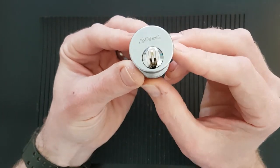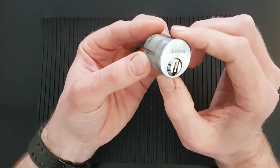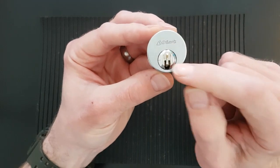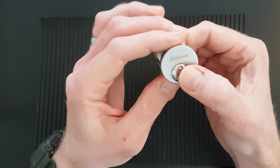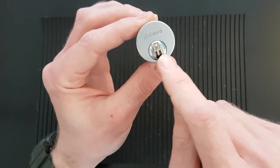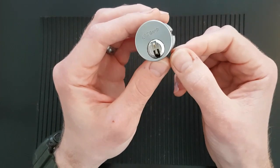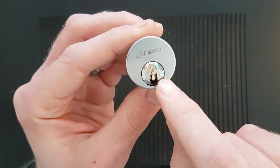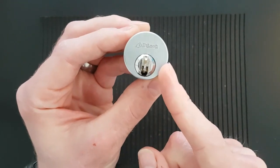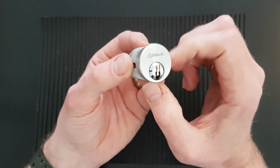So I thought perhaps I need to fashion a key. I did a couple of YouTube searches - I didn't know anything about this when I bought it - and I came across a video by Rookie Lock, quite an old video, and he made a key for it. The more I looked into it, people were saying you could make a Bi-Lock key out of a credit card. A Bi-Lock key is like a U-shape with two different rows of bitting that operate independently.